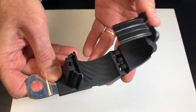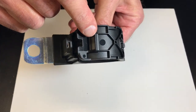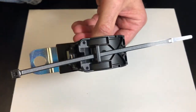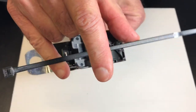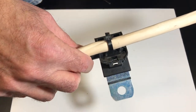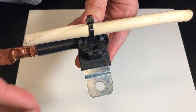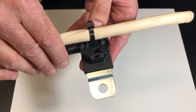On the top there's a saddle, and that saddle is meant to hold a conventional tie wrap. So you could have the P-clamp holding a wire harness on the inside, and you could have a tie wrap on top holding a hose. In fact, I've put together a little unit here — we've got cable on the bottom and conventional household wiring on the top. This is great American ingenuity: you're using one P-clamp for two hold-down purposes.